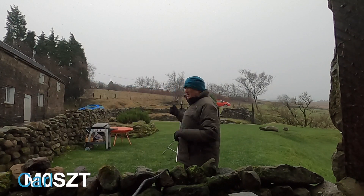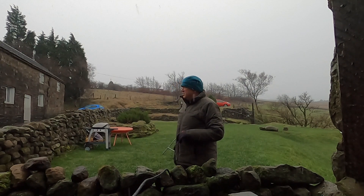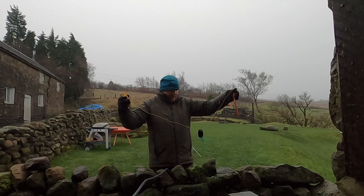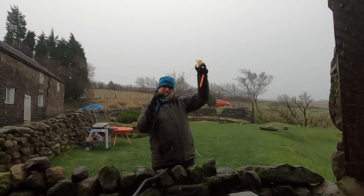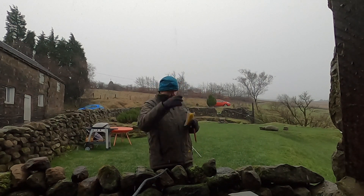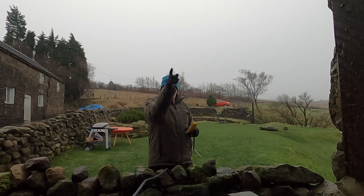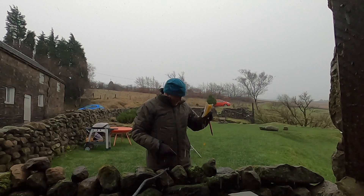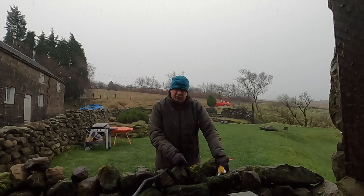I'm taking down the 17-meter antenna because the band has really dropped out. I'm going to use this end-fed antenna — I've got an isolating bit there as well. I'm going to put that over the top of the mast and run this wire up and then back down again, so it creates almost like an inverted-V but with the end-fed, and we'll see if we can get on to 40 meters with that.